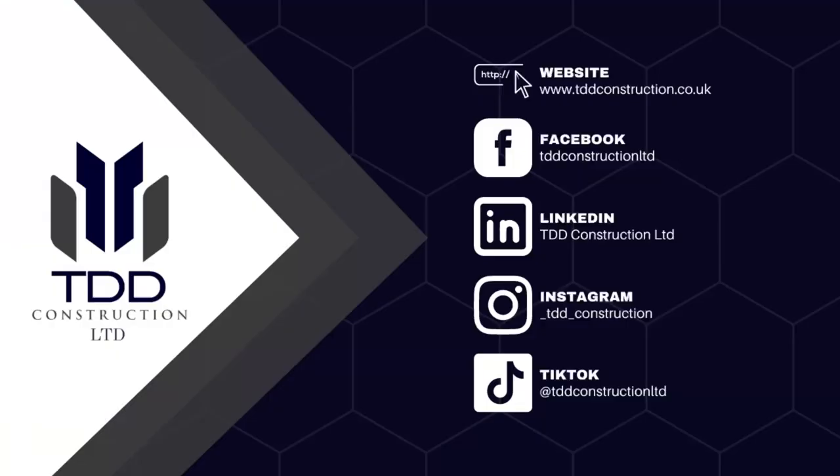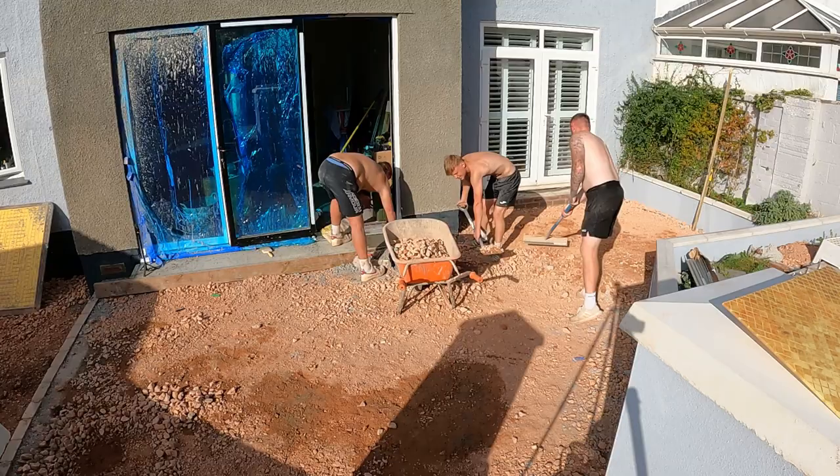That's the end of this week's vlog. Thank you very much for watching. Don't forget to like and subscribe — hit the notification bell so you're always notified for our latest videos. We're all finished now so I'm absolutely knackered. What did we do today? So today was finishing off all the hardcore, finishing off the top layer of granite dust on the top half, and then we also compacted everywhere. So all three sections are all done ready to go. All we've got to do next week is finish off the bottom patio sections, some granite dust across, compact that ready to go. Monday we're hoping to get the risers done for all the steps ready to go — that allows us for Tuesday to glue them all in place, bead everywhere and then do the top section. I reckon Tuesday, Wednesday completely finished. Job done. Happy days. See you next week, have a good weekend.